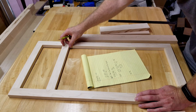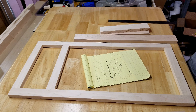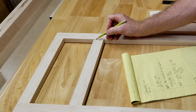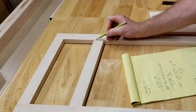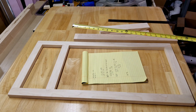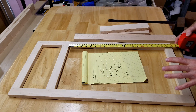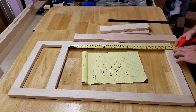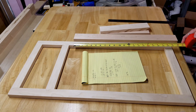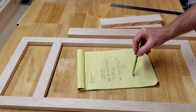I decide whether to go 20 and three-quarter or do the exact math on the 13 sixteenths. I've pencil-marked my frame to represent the inch and a quarter overlays. I want six-inch drawer panels that just barely come down below to catch the frame, giving a quarter inch at the top. But with an inch and a quarter overlay at the top for my door panel, it'll only leave about an eighth of an inch between my drawer and door. So to fix that, I'm going to move the door down about an eighth of an inch to get a quarter inch reveal between drawer and door.